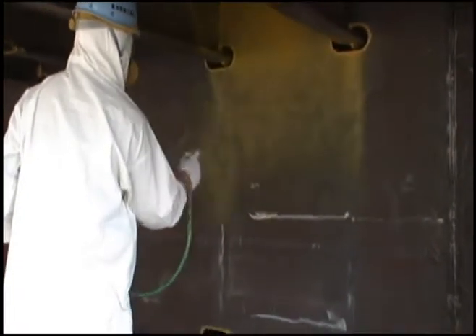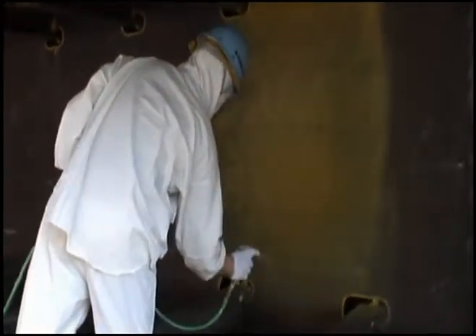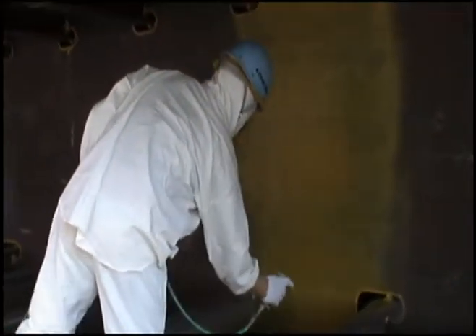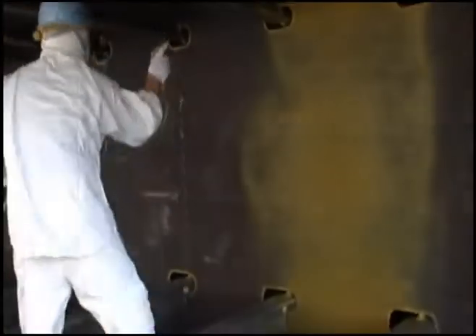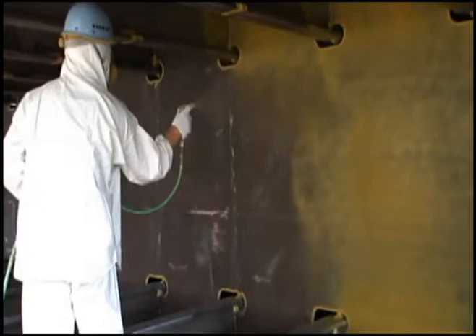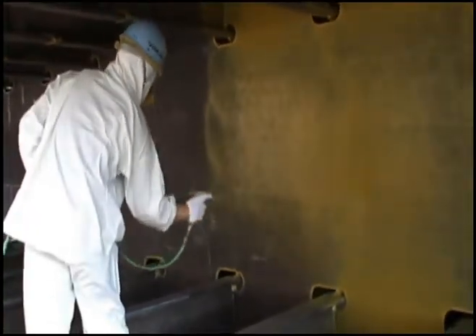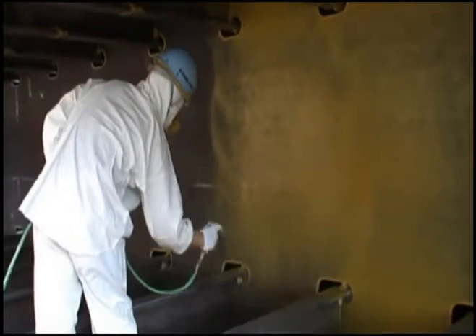The painter has started to spray the first coat. Please watch carefully. The coating does not hide the steel plate. General paints cover steel plates with this kind of thickness — 20 to 30 microns dry is enough thickness to cover the substrates.